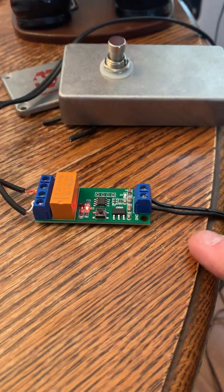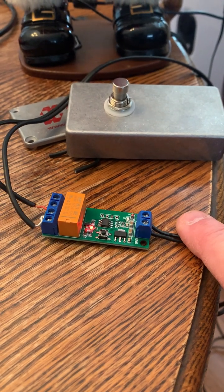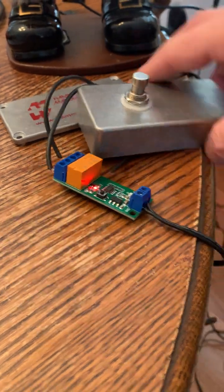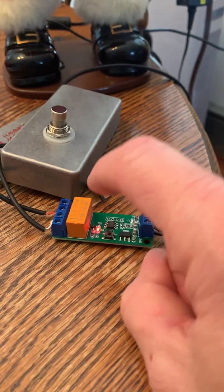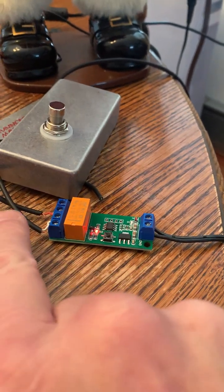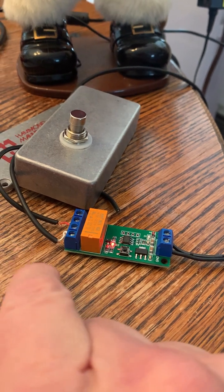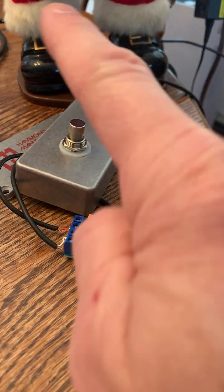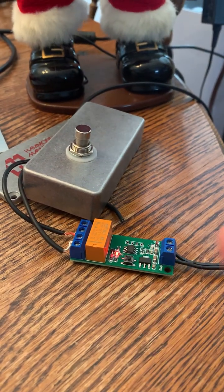The way this is wired: I've got a 5-volt wall wart powering this side of the board, which is actually the circuit board and the relay. On this side, I've got incoming 5-volt wall wart, and then the other side is going to the Dancing Santa motor. So what it's doing is it's flipping back and forth, making the motor go one way, then the other.